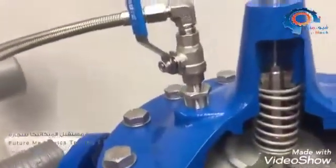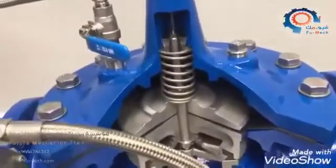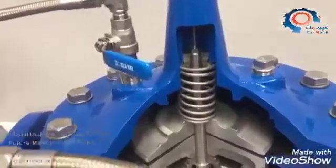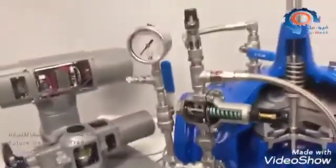Isolation valves on all of your ports is a good thing to specify, because then you can lock your valve in place so it can't open or close. While you're doing maintenance on your pilot system, you can do that without manipulating the flow of your actual system. After that, you have your pilot, the outlet isolation valve, and a downstream gauge that tells you your downstream pressure.